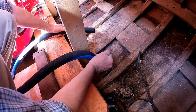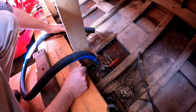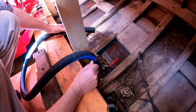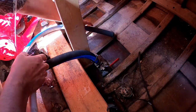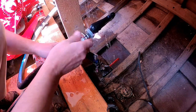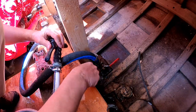In principle, if I open this valve and this end of the hose is lower than the water level, water will come out. If for some reason I can't close the valve and I'm in trouble, all I have to do is raise this above sea level and we'll be okay. This has a latch on it — water should come out once I open this valve. And there it is, nice. Water should stop when I close the valve. Very good — we have an operational ball valve, not exactly a proper seacock, but it'll get me to the haul-out where I can replace it properly. To make absolutely sure the through-hull is as clear as possible, I'm going to use this Liveaguard backflush tool to blast pressure back out through the through-hull and blow out anything accumulating around the mouth of it.